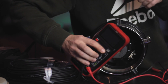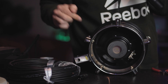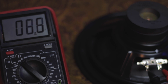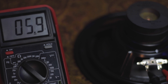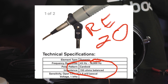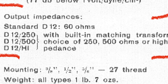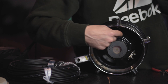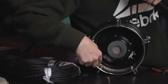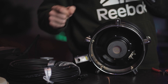We're also going to check the impedance of our sub kick. More than likely, we're going to need to build some sort of attenuator. We can see that the speaker by itself reads about six ohms, and a six-ohm microphone I think will be very loud. I'm also going to try to rig the third pin — since the speaker just has a negative and positive, I'm going to try to mount pin 3 to the chassis. Maybe that will help with noise.